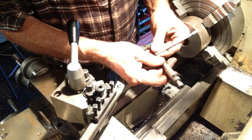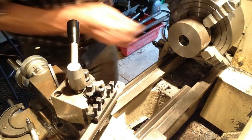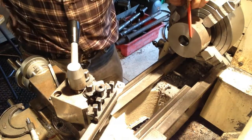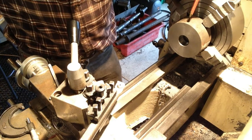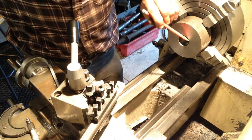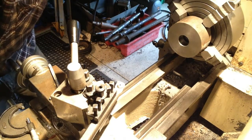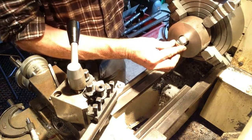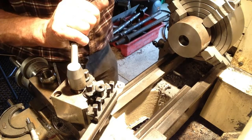That's bang on — inch and a half — so we've had some success. The next op will be a bit of profiling work, which is just freehand on the outside, and then we flip her over and we have to mill two slots. That'll enable us to get our bush into the hole, and then it will rotate around sideways and be in its location. So we'll move on to the next op.